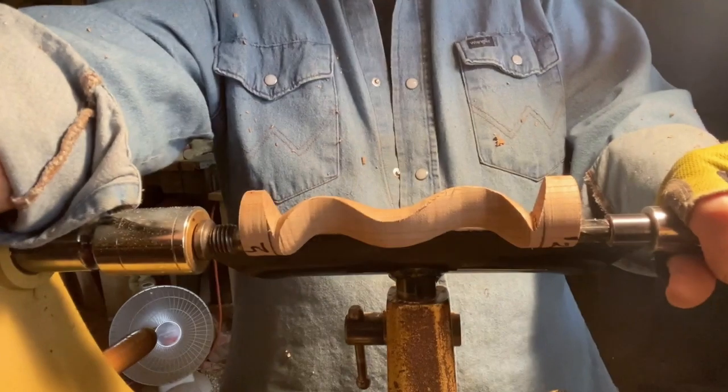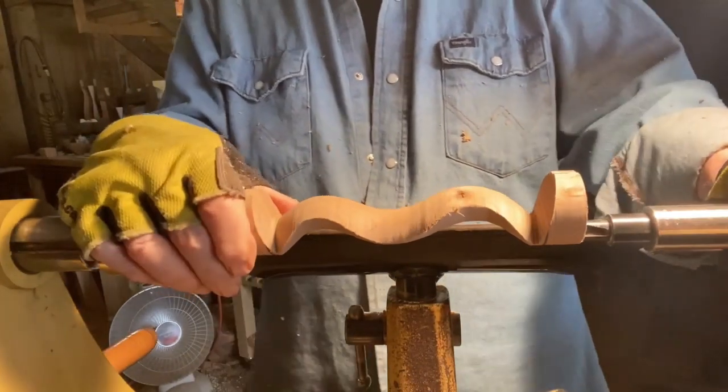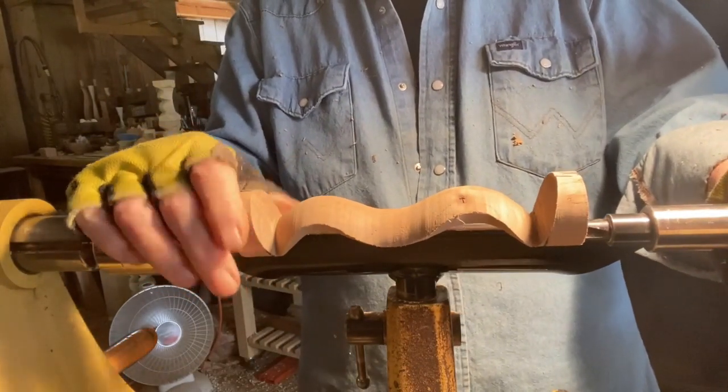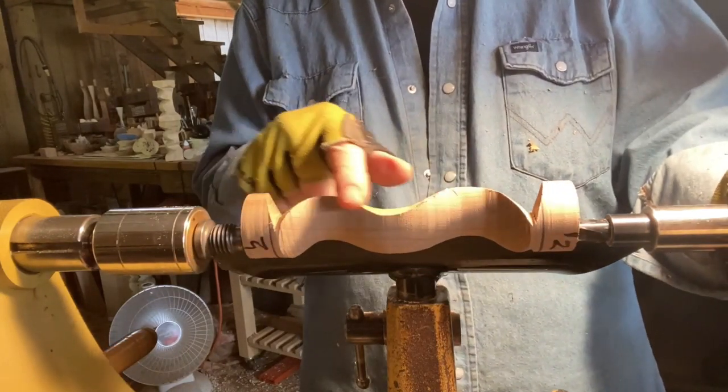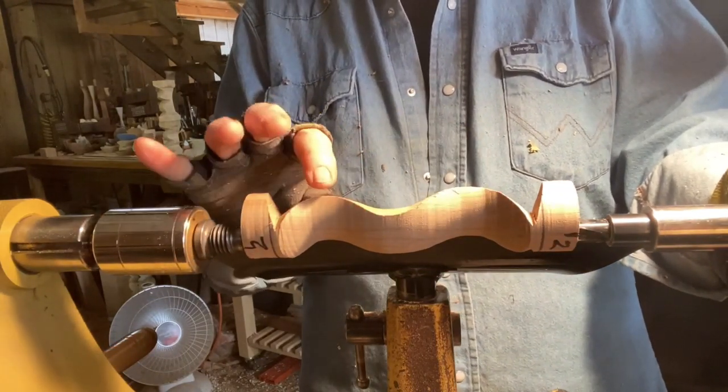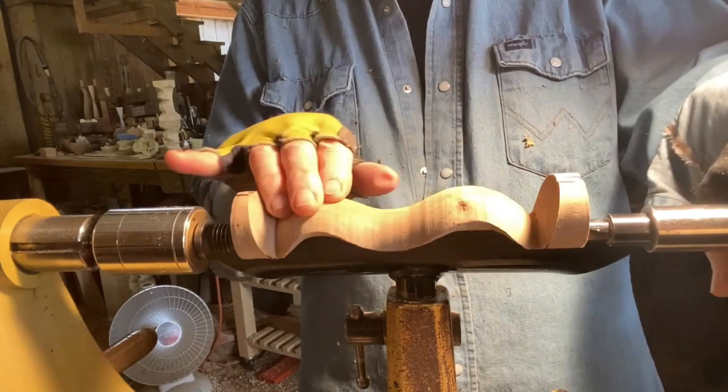So that's how that spindle is done. All the sanding on these archetypes should be done off the lathe. If you try to sand it as it's rotating, you're going to interfere with these wonderful intersections of the profiles. So I always sand these off the lathe.